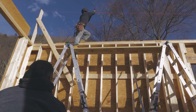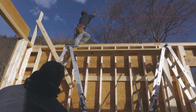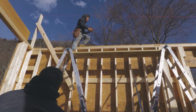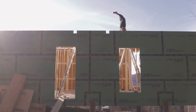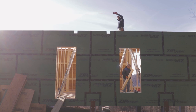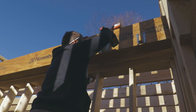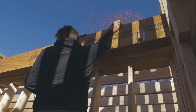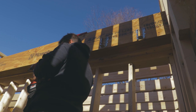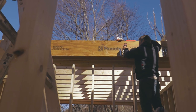One of the interesting things about this house, it's a single slope roof, which means they're just roof joists and there is no attic space on this house. The one roof where our bedroom is here, which is the longest front to back, it's 50 feet of an upsloping roof. That had to be broken in half with the roof joists because we couldn't get roof joists that long. And even if we did, they would have needed support in the middle. So we broke those roof joists at approximately halfway onto an LVL beam above the ceiling.